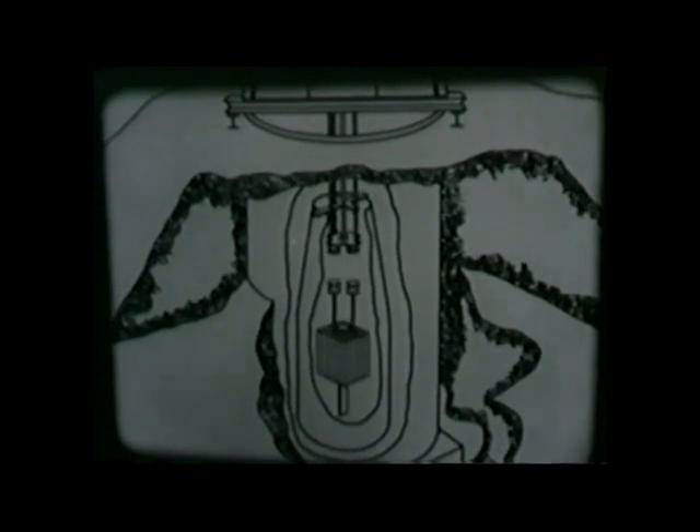The reactor contained five neutron-absorbing control rods, which could be positioned by a mechanism contained in the plywood box above the reactor. The rod shafts also contained spring-loaded magnetic couplings which, when released, allowed the rods to drop freely downward under the acceleration of the springs plus gravity. The center rod, when released, dropped downward out of the reactor. The other four rods, when released, dropped downward into the reactor.